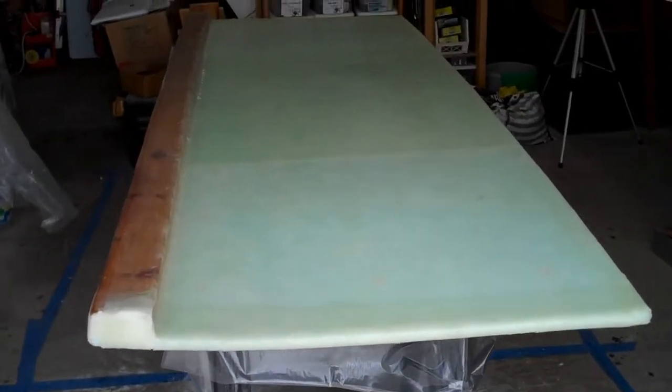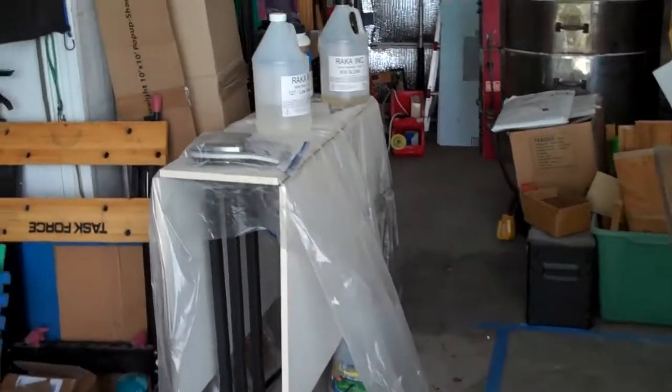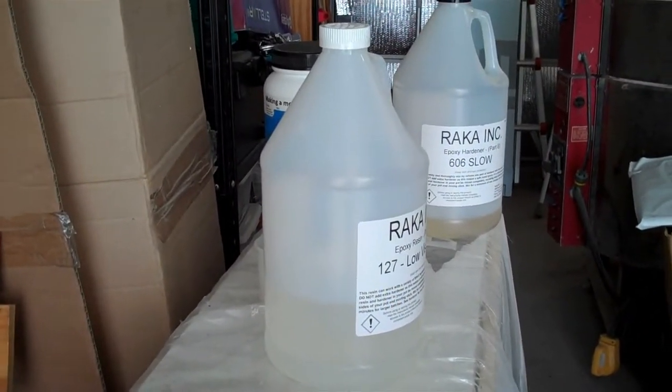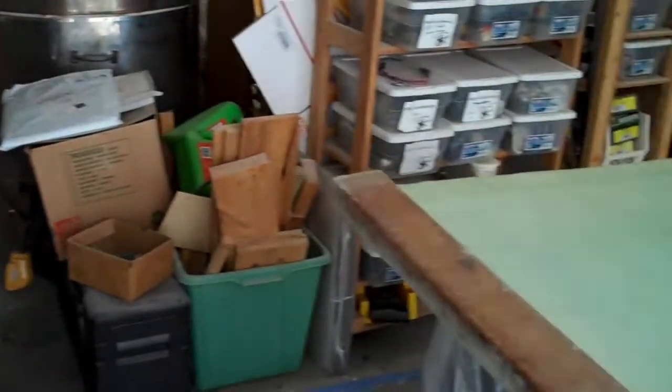That's the last of the fiberglass on the top here. You can see here how far my fiberglass went down, so I probably used 3/4 of a gallon over this single chop strand mat sheet. I put it on pretty heavy because this is the top sheet.